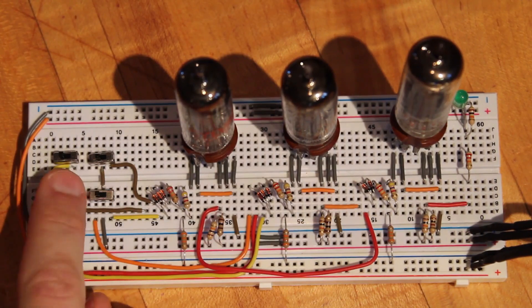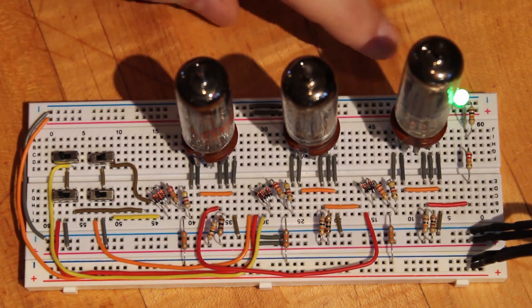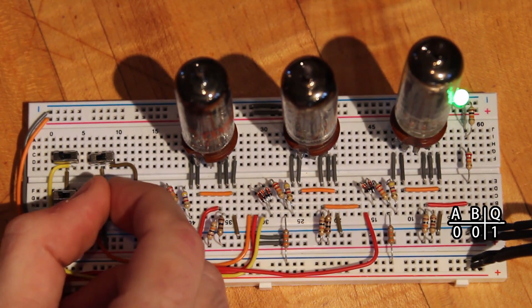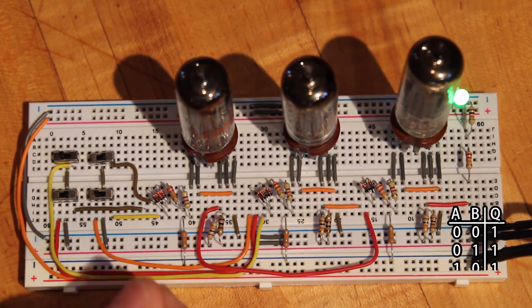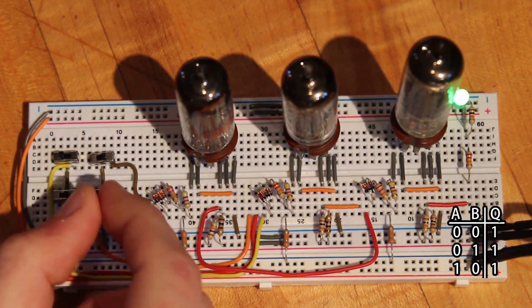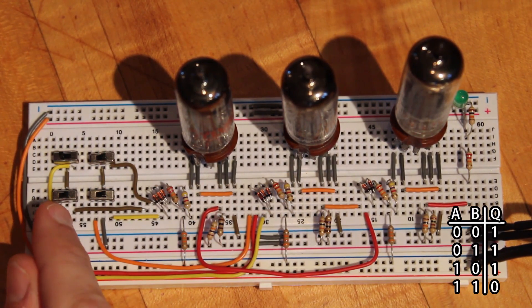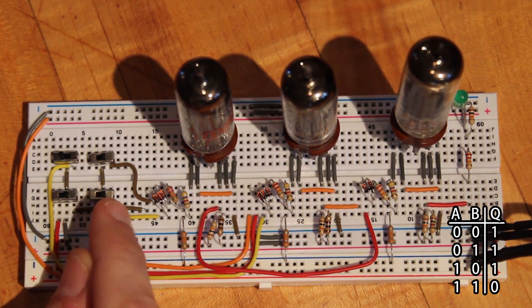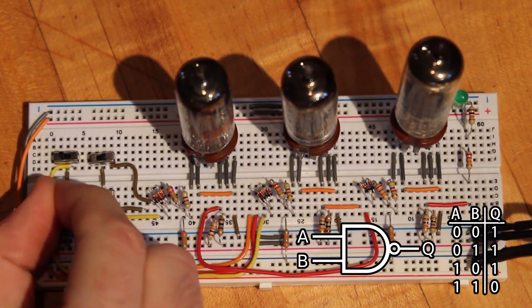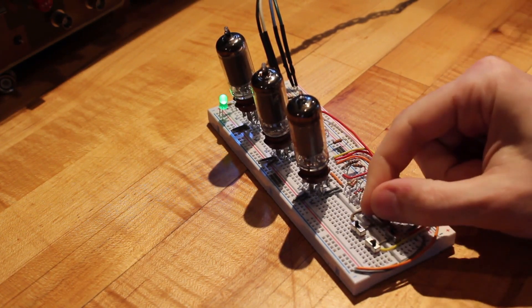Let's turn data and result register off and see what address one does. Flipping the address — hey, the LED came on! So whatever it is, it's inverted of something. Let's flip one switch — nothing. Let's flip the other — nothing. Let's put both data and result register on — the LED went off. So we have something where if data and result register are both one, the output is zero; otherwise the output is one. That's a NAND gate — a truth table I recognize. So address zero, zero is exclusive OR; address zero, one is NAND.